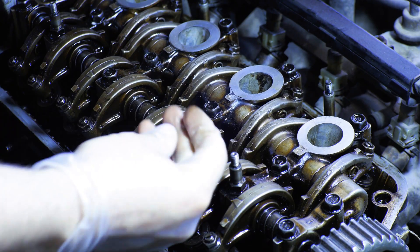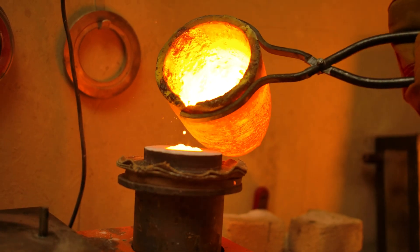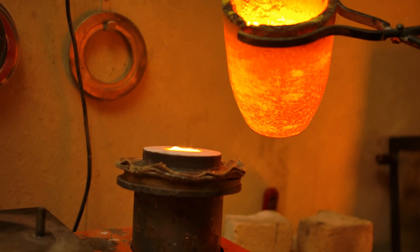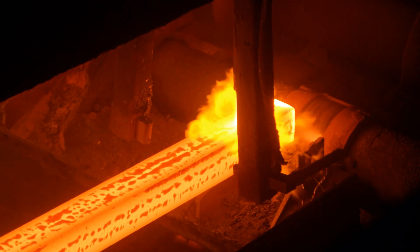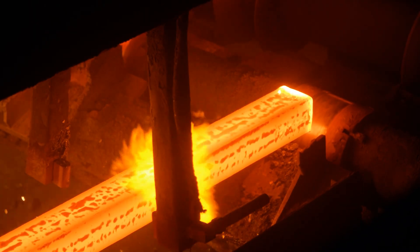But let's back up a little bit. Why do we outgas anyways? We outgas parts that are very greasy or oily. Even if they've been degreased, there can still be trapped oils that will gas out, so it's a safeguard. We also outgas cast and galvanized metals because even though on the surface they may appear clean, the manufacturing process of these metals creates a condition where contaminants get trapped. And if you don't outgas, those bubbles will get pulled through your coating and ruin your finish.